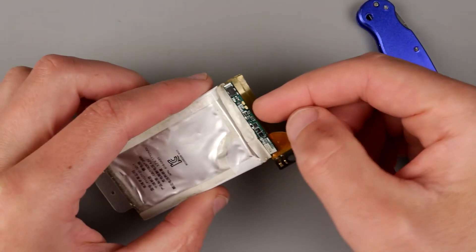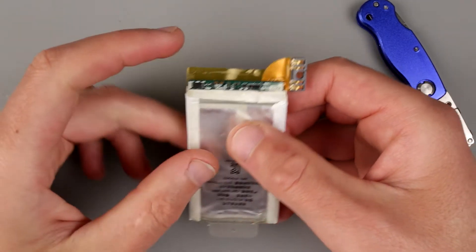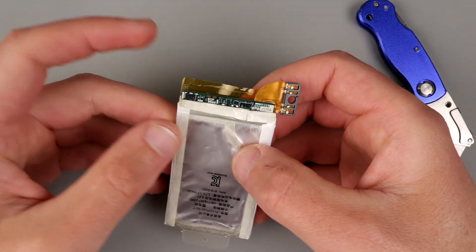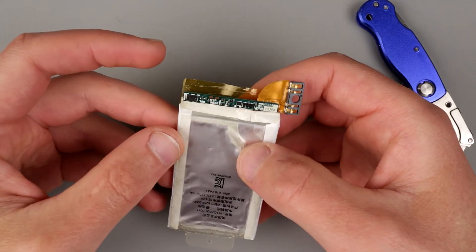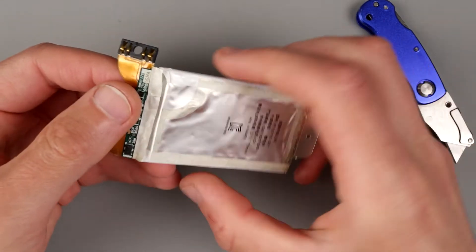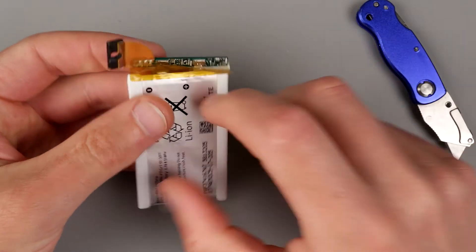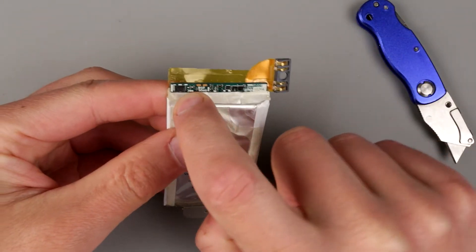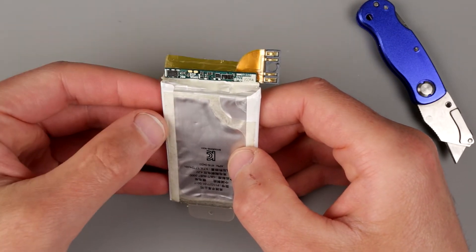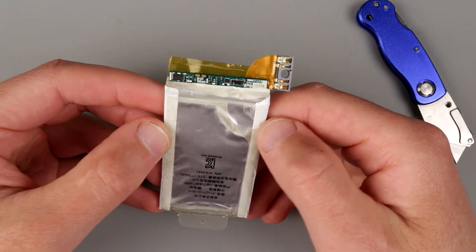I may just do an experiment — pull this out, disconnect it, and for example connect one of my previous teardown batteries, like a Dell battery, and try to use it — it may just say forget it and not work. But it may work; it depends. I'm gonna take a look at this in a bit more detail, but I may just salvage this little board for giggles and keep it in my parts bin. There is also a specific protocol — I think it's one-wire protocol — that you can use to talk to these controllers, and you can reset them, unlock them, and do all kinds of nice things with them. But it's all quite a bit complicated and I don't have the cycles or the necessity to dive into it.